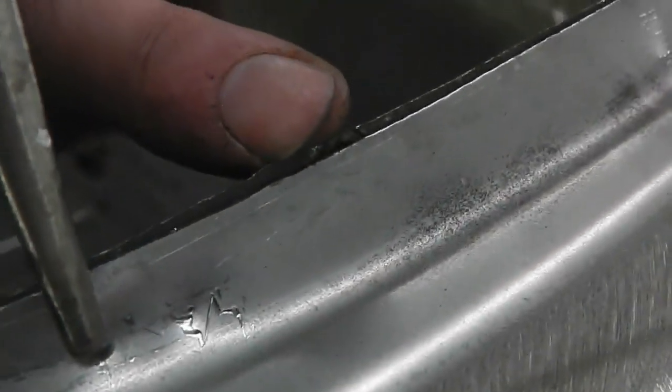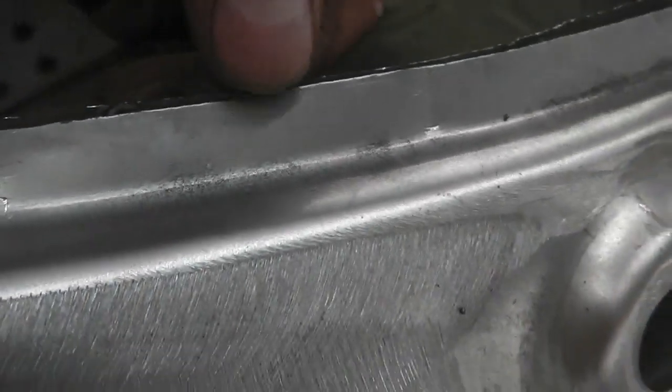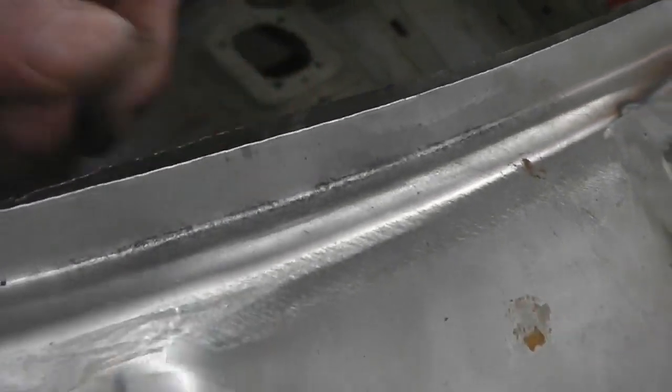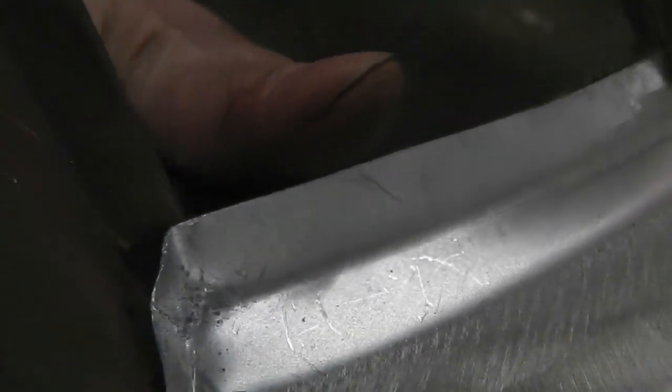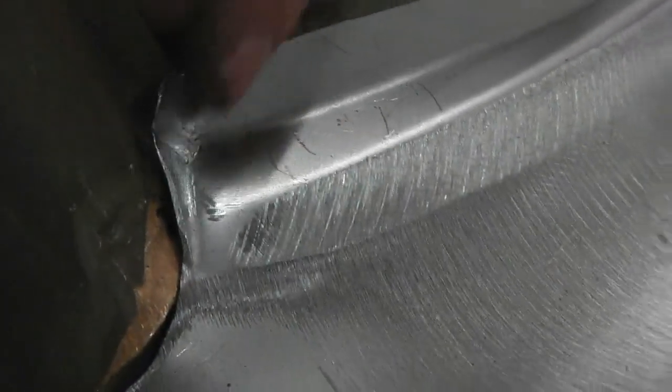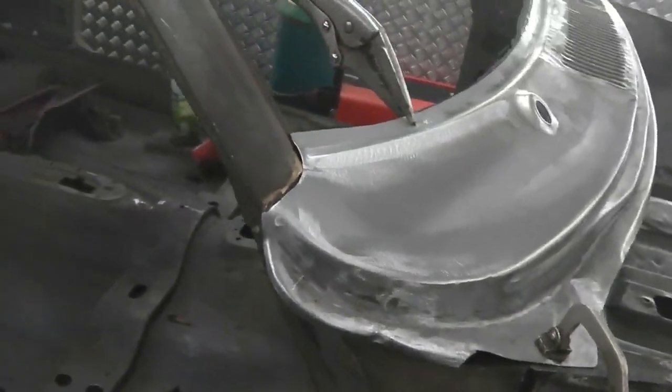If you look very closely, just overlapping. If you look at any Cortina, you'll always see little bits of overlap where the panels don't always follow each other there. So that's normal. Round this corner, we have to watch out. Let's take a little piece off so that brings that shape in for the windscreen. Clamp up and then double check our measurements.